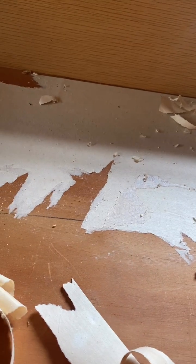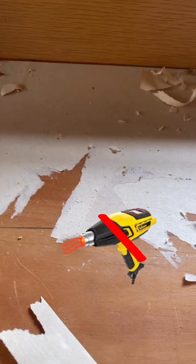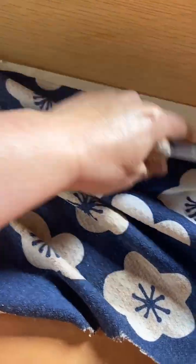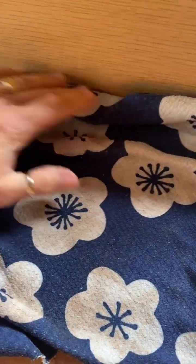This one of the middle drawers is proving to be a little bit more tough, so I thought I'd show. This is what was in here — don't use a heat gun on something like this because you're gonna burn the drawer before you get it up. Just put a damp towel all over it and rub the cloth in there to get it all damp.